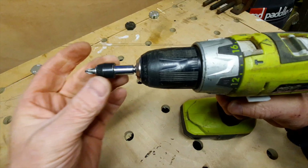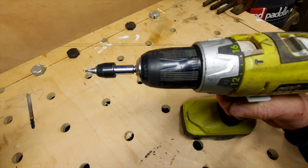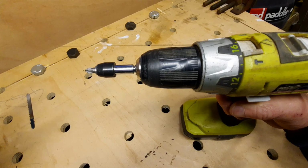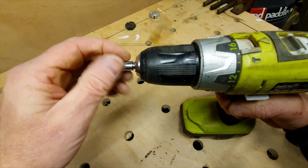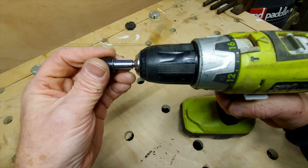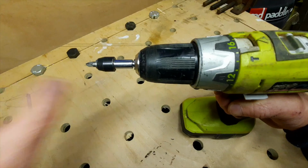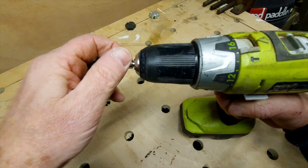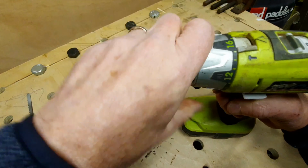The hammer drill function of it works perfectly adequately, as well as any other battery powered hammer drill that I've possessed. The disadvantage with hammer drills as opposed to the SDS type percussion drills is they don't drill in hard materials as well. So these don't cope generally on hard materials like concrete or engineering brick. That said, it's more than capable. If it's all that you can afford as a first tool, then I've got to be honest, this is what I'd get.